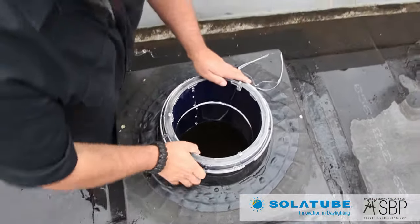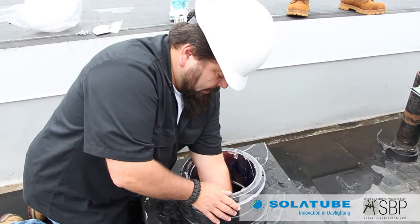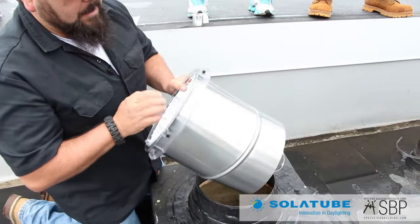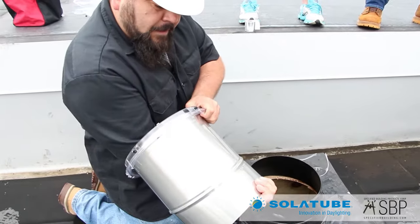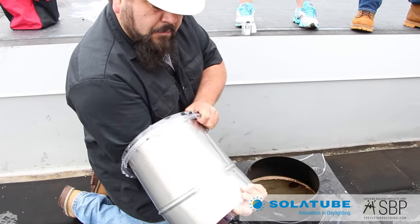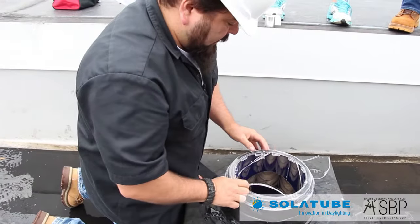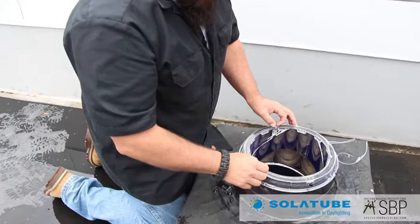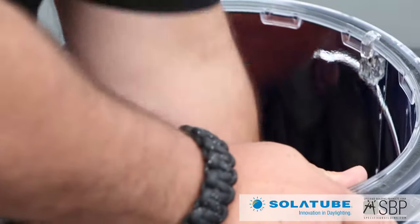It's pretty straight. What I'm going to do is from above here, as I'm holding this down, I'm going to reach inside and make an angle as I'm pulling it down. I'm holding down on the ring from the top and then grabbing the angle to move it as it's inside the flashing. If I'm just about where I need to be, I can take the tabs here and actually move the tube around to wherever I need it to land.